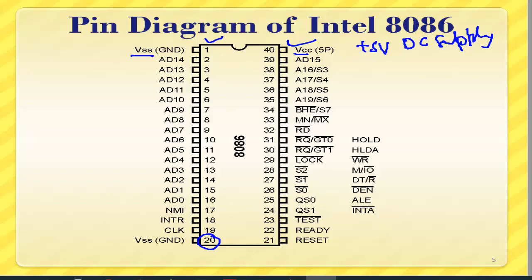So remember, pin 1 and pin 20 are ground, pin 40 is the VCC, 5 volt DC supply, and we covered here from pin 2 to pin 16, these are the multiplexed address and data pins AD0 up to AD15, and also AD15, that is pin 39, up to pin 35. But these guys are multiplexed with the status bus. So what are S3, S4, S5, S6 doing? S7, I told you it's undefined, it's not used, it is idle. And these other guys have a specific meaning, which we will do in the next video, inshallah.